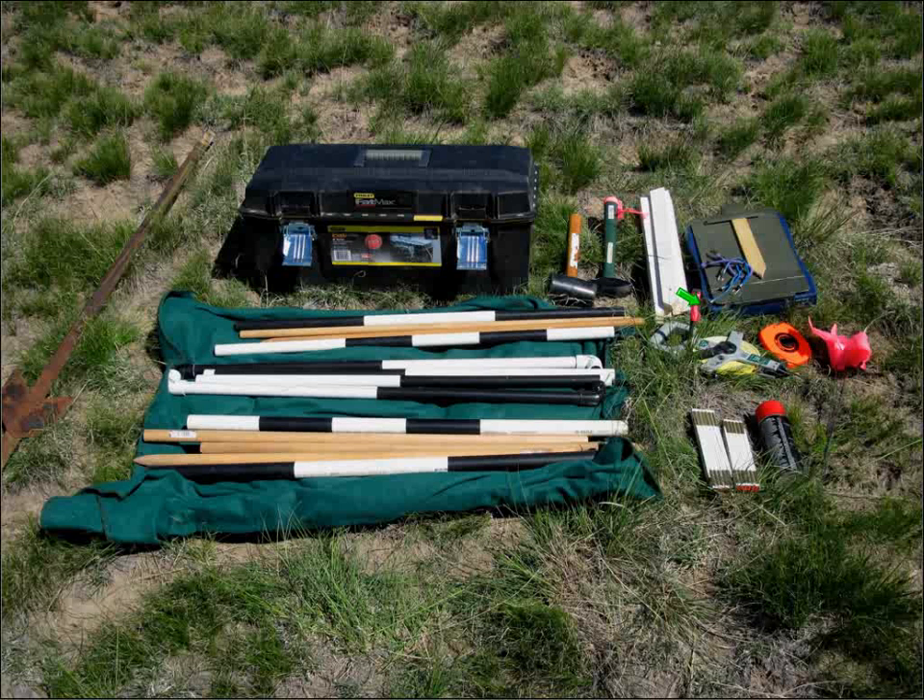You can take a large spike and drive it into the ground through the handle to hold the tape in place; it's much more difficult to do that with the other style. A potential alternative to the PVC frame — for which you have the instructions through the link Tonya provided — would be to use folding wooden rulers technically referred to as brick mason rules. These are six-foot-long folding rulers, so you can fold them out and bend them at the three-foot line to have two sides of a square.